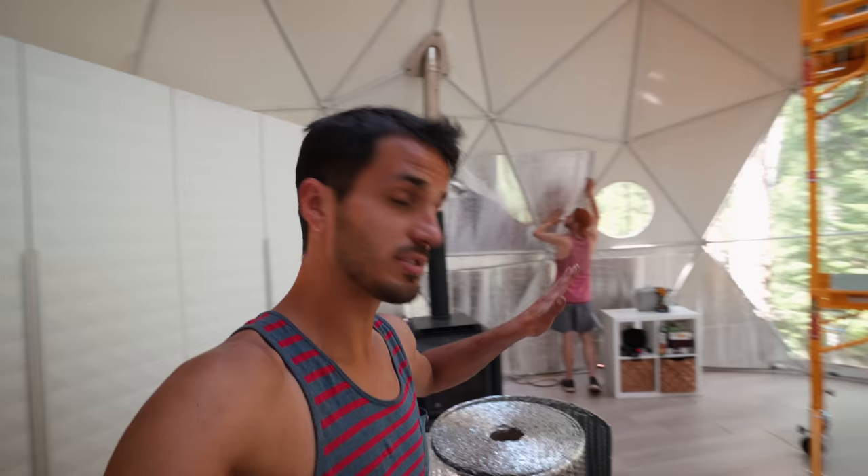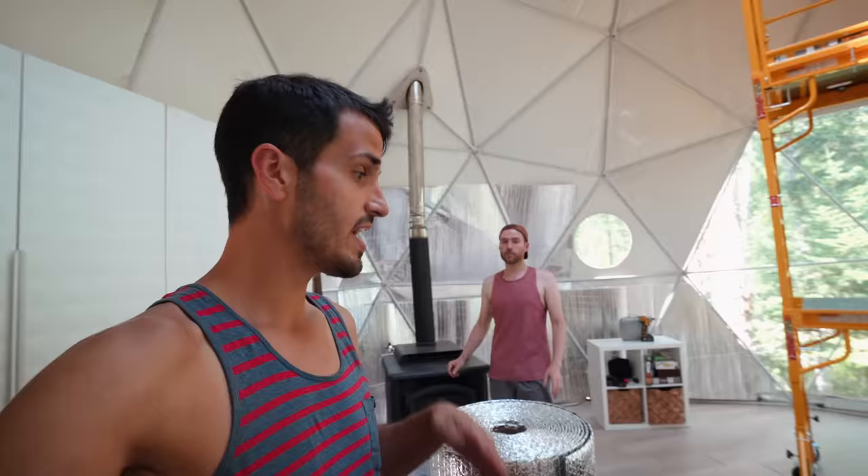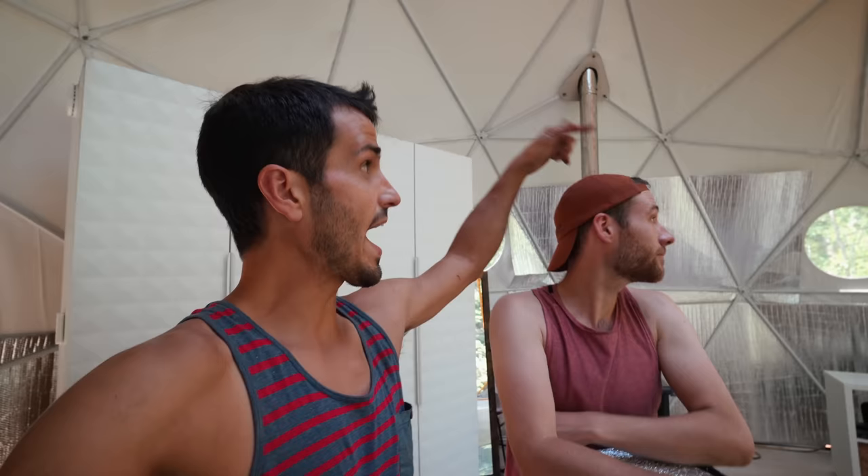The product we're going with is Reflectix, which is like bubble wrap with foil around it. The way it works is it creates an air gap and stops heat from going outside of the building, as well as outside heat from entering the building. We're going to weave it through on the outside of the bars next to the PVC liner. The new quilted liner we have has this already sewn into the back, so those bars are going to give us an air gap and really bump the insulating value.